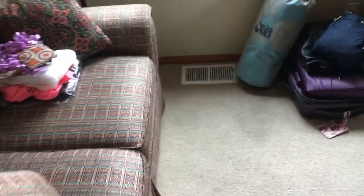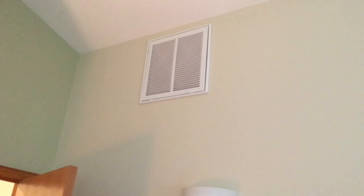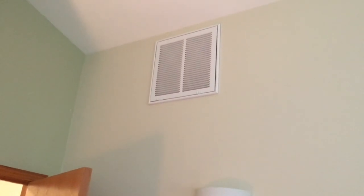Inside, this room is pretty cold, so we went ahead and added a six inch by twelve inch diffuser right under this main window here, which has really helped. We were also worried about it getting a little stuffy, so we went ahead and added a return as well, so that should take care of those two problems.